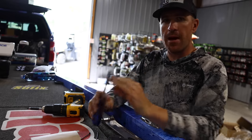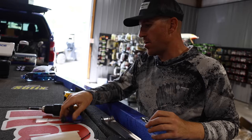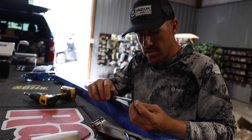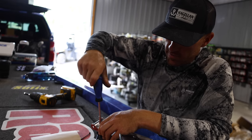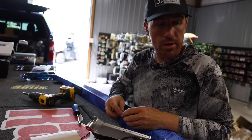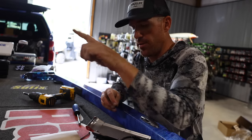So the mounting bracket is on the back of the boat — it's level and good to go. For the next step, I'm using a screwdriver rather than a drill, because you risk stripping when attaching the transducer itself. These are around 800 to 900 dollar transducers, so take your time with a screwdriver. An interesting note on this new Lowrance design: the wire comes out differently compared to the old Lowrance — it actually shouldn't get kinked as easily, which is a smart design improvement. I'm tightening it just enough so it's firm without risking busting the crystals inside the transducer.